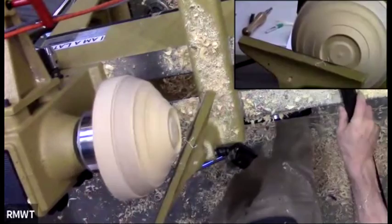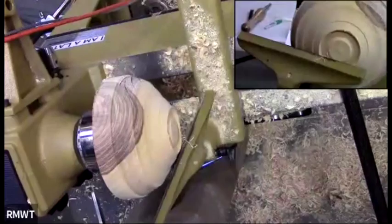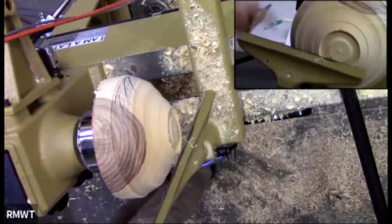I'm not a big fan of movable headstocks. So the vibration you're hearing here is not the chuck. It is not the gouge. It is the movable headstock. There's nothing wrong with a movable headstock, but it has dirt between the casting and the bed, and they all make this noise. If I take that off, clean it, and put it back, that noise disappears. I've done it every time. I've done this at least 100 times.